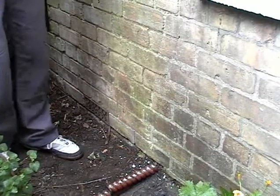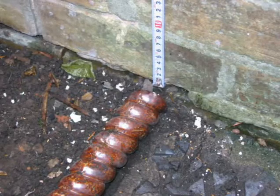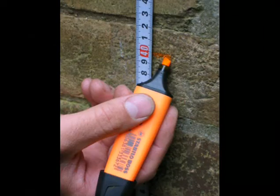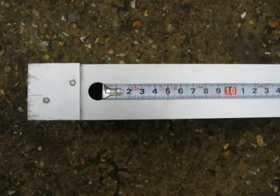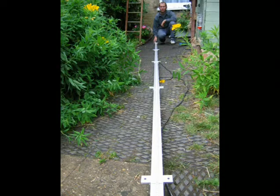Once you have decided how close to the window you want to install the ladder, the vertical position of the ladder has to be marked. You start measuring from the floor level and measure 40 cm from the floor. Make a mark at this height. This ensures that when the ladder is deployed, there is enough space for the ladder to fully open.